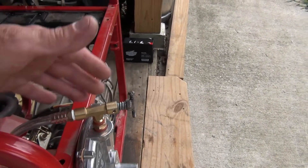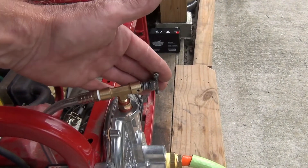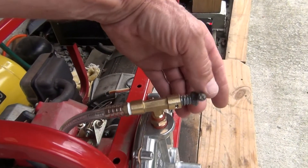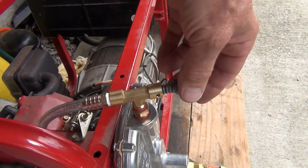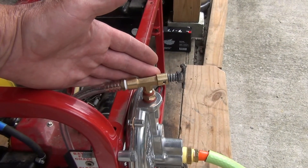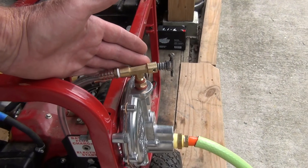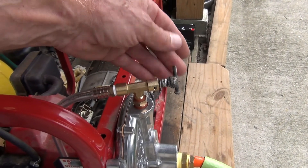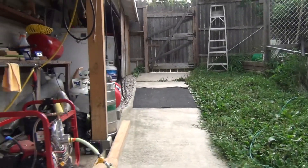Natural gas also has a little less pressure — maybe about one and a half PSI — but that doesn't mean much. For propane this setting is good, but for natural gas I would open it up one full turn. If you want to choke it a little for starting, open it up an additional half turn or a little more.